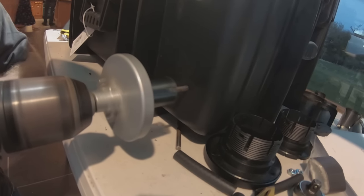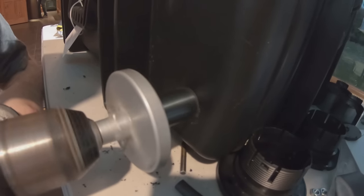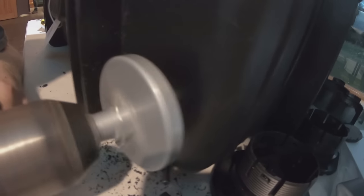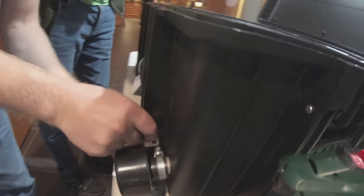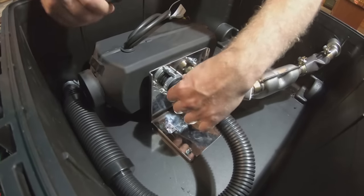You can see the muffler — that really helps with cutting the sound level down. I've seen a few of the Chinese ones where they're not properly welded; they're shocking actually. Here we're cutting the hole in the top of the case — this is for the combustion air intake. And that has a filter on the top of it, which is very useful in the environment you'll be using it, mainly on the back of a Land Rover — so it will be exposed to dust, dirt, and flying mud. That will protect it. It fits through the top and will be secured onto the side of the case. This is a silencer — it just reduces some of the sound from the air intake.